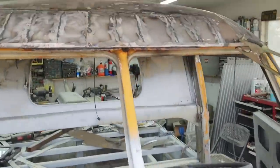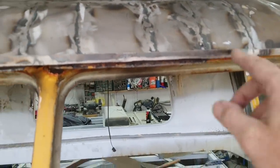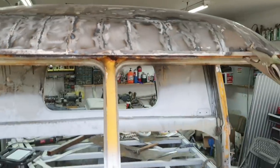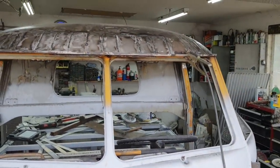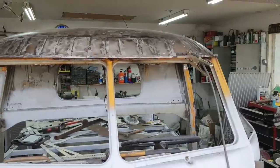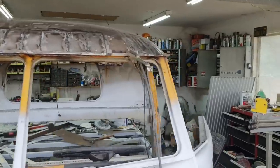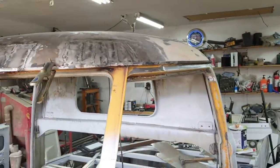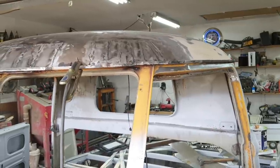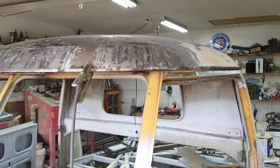I got this thing on here off camera again. I just weld the bottom edge, weld here, and then grind it straight. That's how I do it. It comes out pretty good when it's all painted and primed. When it's primed, you take a look at it and you might have to grind a little more. You can see it better. Sometimes you can't see something on the metal, and then you go to primer. Some guys try and dress all their metal, make it look just like it's not there. I don't usually do that, so I do it on primer.